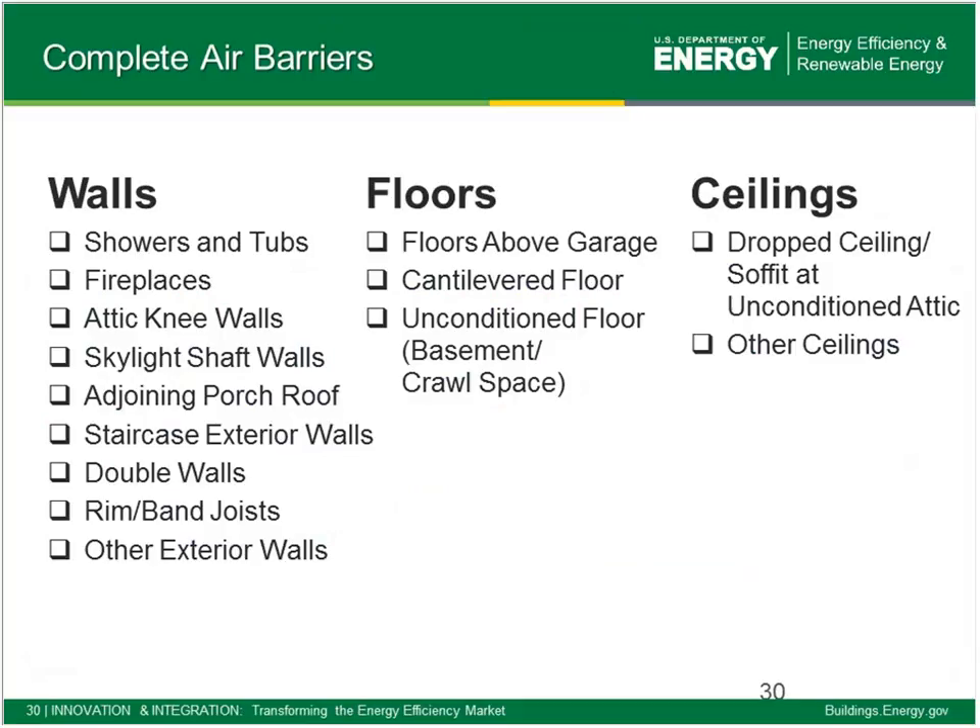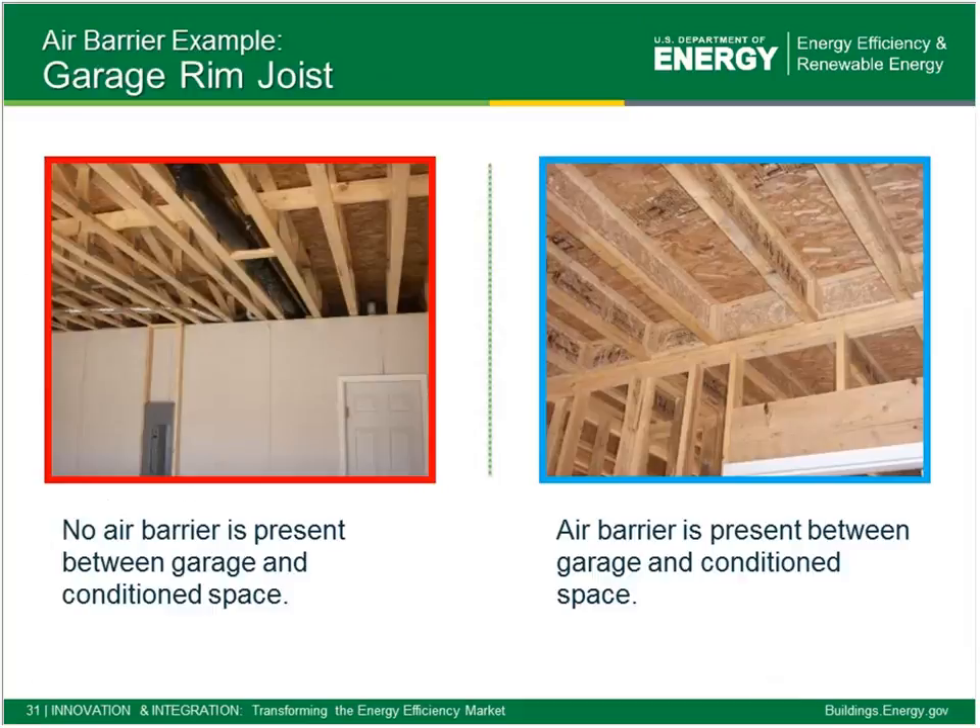For complete air barriers, we have these checklists borrowed from Energy Star Homes. The reason for the checklist is to make sure we're doing all the things that matter and not going à la carte — achieving some good measures but missing others because we don't have a checklist and no one's verifying it. The checklists are a valuable tool to provide quality assurance that we're air sealing all the key areas. For example, on the left a house risks a lot of leakage from the garage over into the living area because of open bays between the floor trusses, whereas on the right, good solid air blocking prevents migration of air from the garage into the living space — that's both an energy issue and an air quality issue.